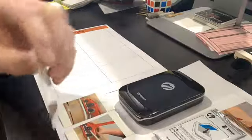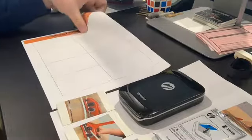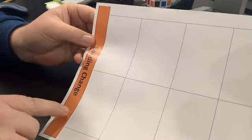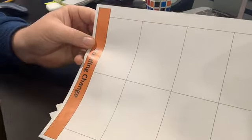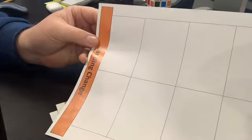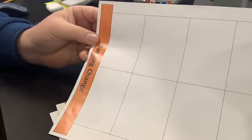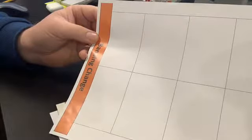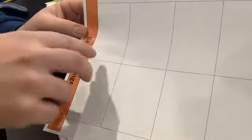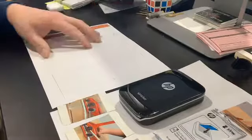I printed out some pictures beforehand — the quality is definitely good enough for an SOP. I figure out the heading on my paper and always add a color code on the side, because it ties into something else on the shop floor — the area, the process, or the type of construction method. The template has eight slots, and if a process has more than eight steps, we break it into a smaller process.